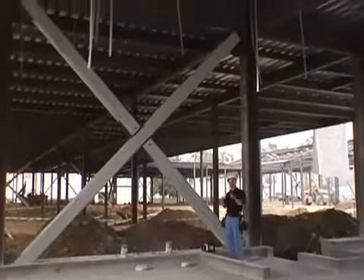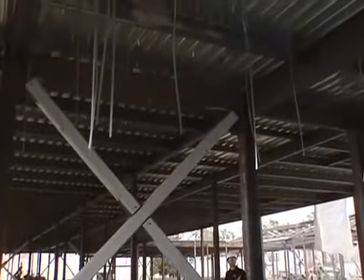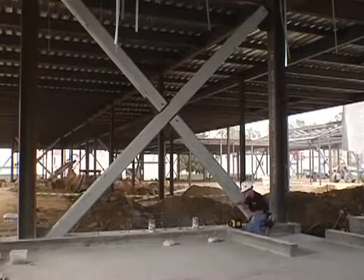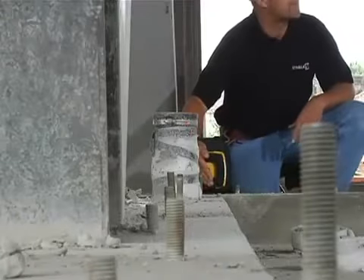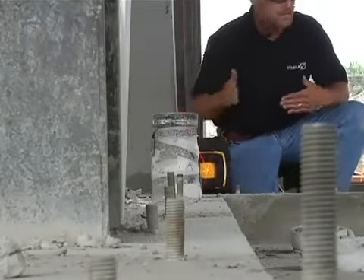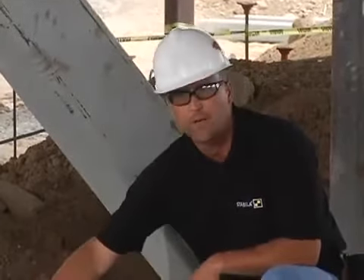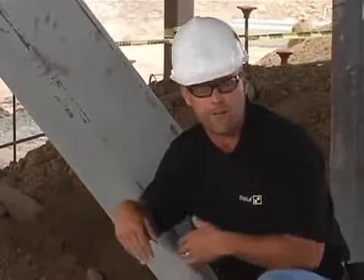Now that the laser is lined up on the chalk line, I know I can take that line and put it up there on the deck. The laser is actually doing one more thing I want to show you. If you look out of the top of the laser, there's a beam coming out. That beam is a 90-degree beam. No more doing 3-4-5 with a tape measure or a large reel tape — all I have to do is take this laser beam and transfer it down to the concrete, and I've got 90 degrees automatically.